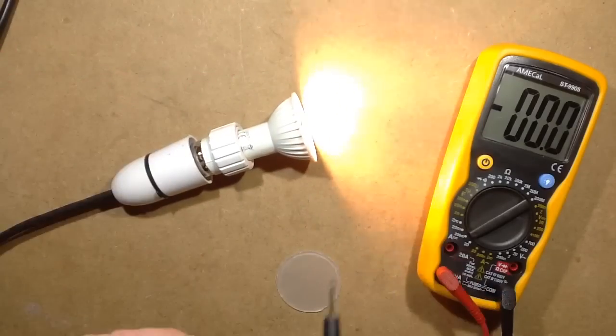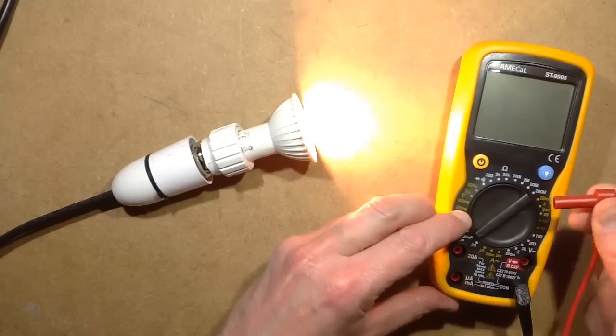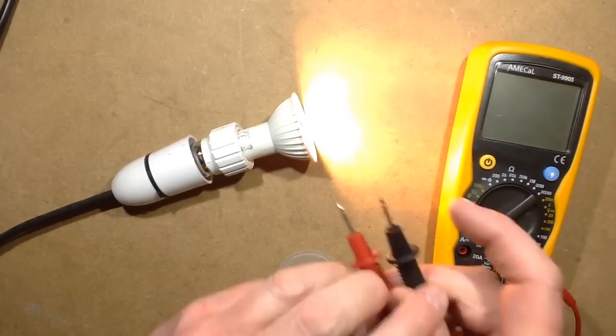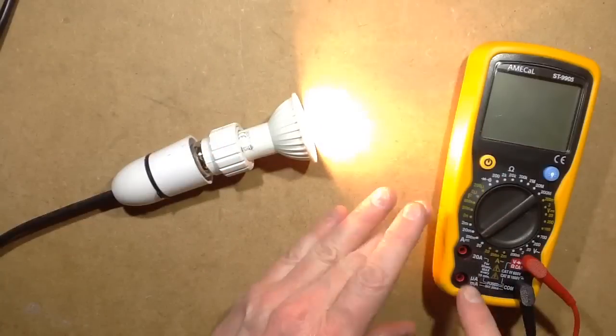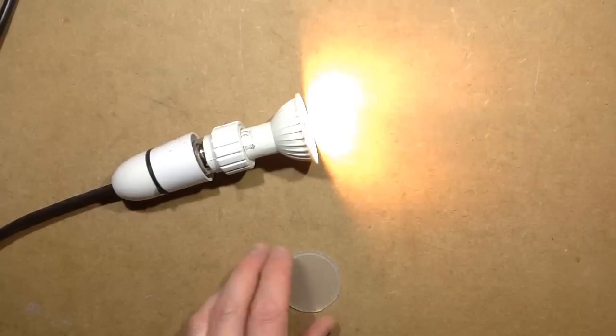And I've had a close look. I'm going to change this lead back over to volts ohms. You'd never want to leave it in the current setting in case you pick up the leads and just ram them into something, because the current setting is a dead short. I've mentioned that before, I'll mention it again because it's worth mentioning every time.